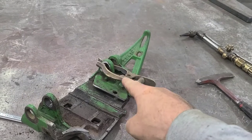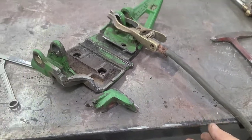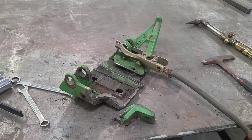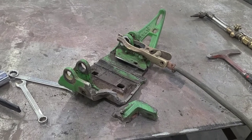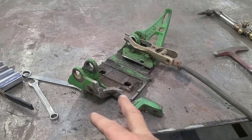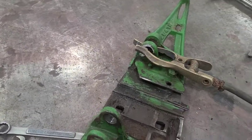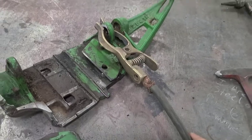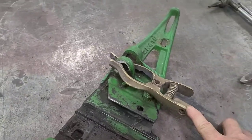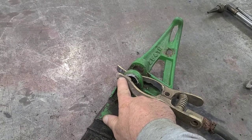When it comes to connecting a ground clamp for arc welding, a lot of times we'll just put the ground clamp right on the table. If you're fabricating clean metal, that works great — the piece is grounded wherever it sits on the table. When you're dealing with a part like this that's dirty or has paint on it, or if you need to avoid arc burns on certain areas, then you need to ground directly to the piece. I cleaned a spot right here specifically to get a good ground connection.